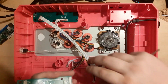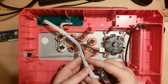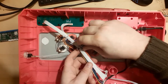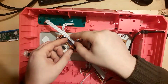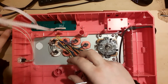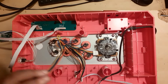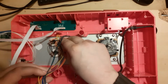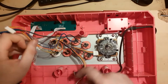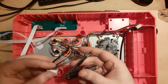Cut everything away from the PCB with confidence — we won't be needing any of that. Now cut off the plastic clips tying the various wires together. Spread the wires coming out of the joystick, the wires coming out of the start/select area, and the ones coming from the push buttons. Put everything to the side. Each push button will have two wires coming out of it. Cut all 16 wires at the base. They might be split into two terminals or screwed into the PCB individually — doesn't matter, cut at the base.